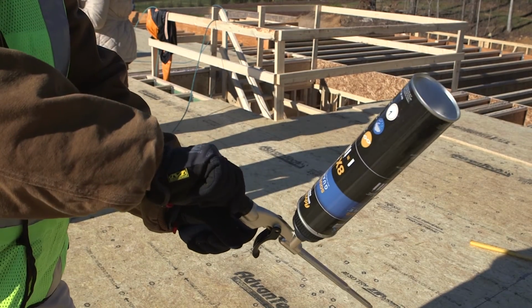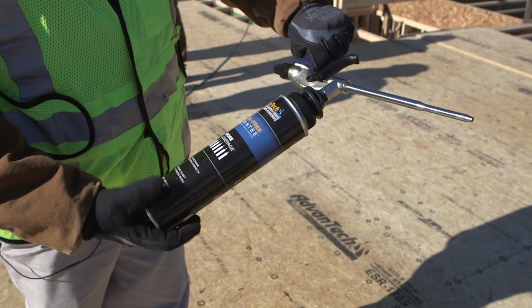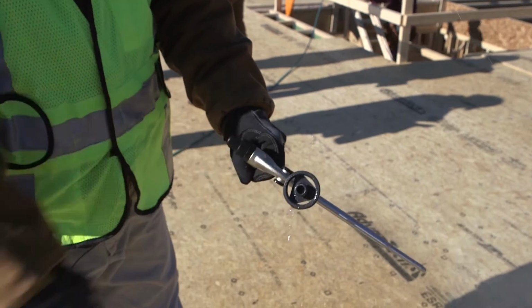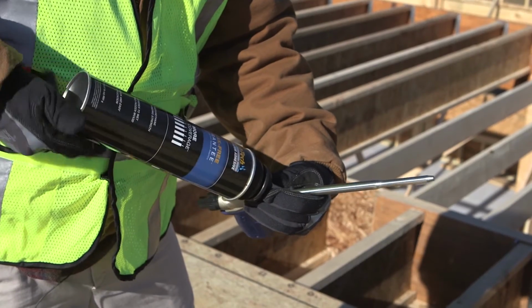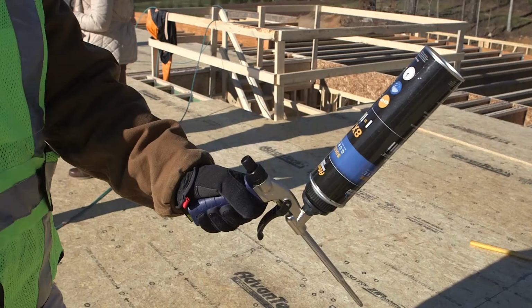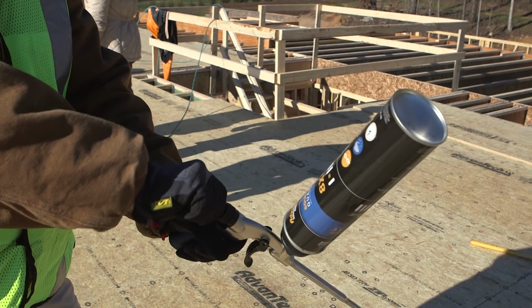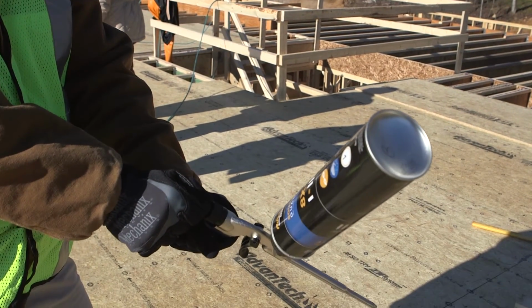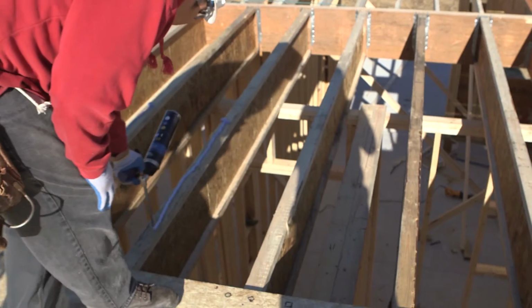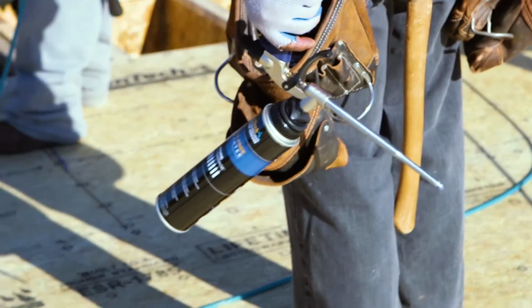When it's time to replace a finished can, close the control knob, remove the empty can, and spray AdvanTech Polyurethane Foam Cleaner in the basket as needed. Immediately install a new can of adhesive. Shake and continue working. When you're done for the day, if there's still adhesive left in the can, simply shut off the applicator by turning the knob clockwise until it stops. You're done. It's that easy. And you can store the applicator gun with a can of adhesive attached for up to 30 days.